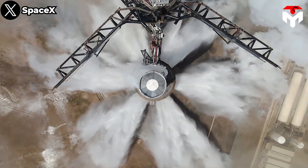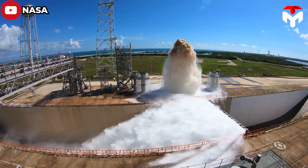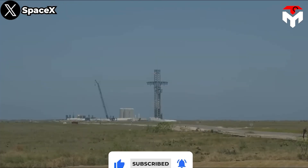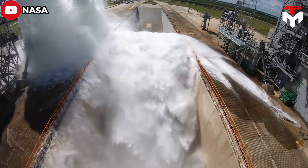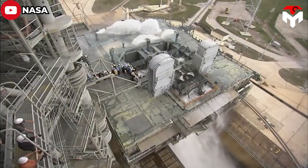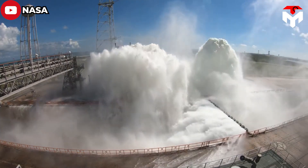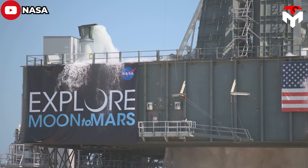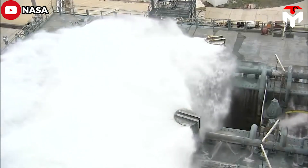The amount of water used for each test ranges from 350,000 to 450,000 gallons, which is similar to the capacity of the system in NASA's Launchpad 39B. Those are solid proofs of how simple and effective SpaceX's system design is. In contrast, in Launch Complex 39, the water deluge acts like a fireman with a hose, spraying water from top to bottom to extinguish fires and reduce sound waves from rocket engines. NASA engineers are not afraid of damage to the launch mount because there is a fire trench underneath. This makes NASA's launch mount far more complicated, consuming a huge land area to hold a flame trench and the hardware of the sound suppression system.